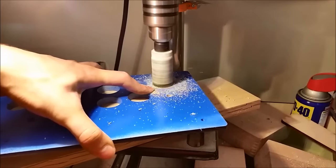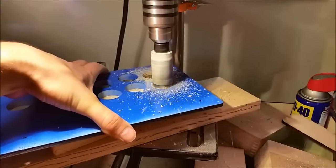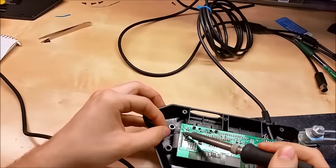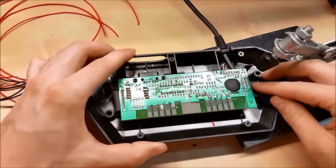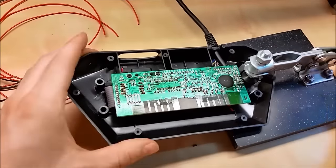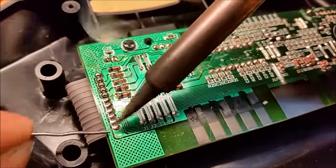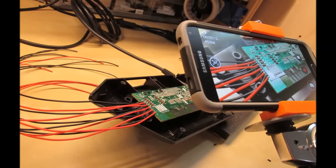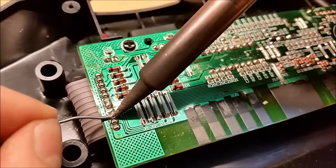Since I changed my mind and I'm not using the Konami pad, we need two more holes — so a total of six: start, select, and all the shape face buttons on the PlayStation controller. We're going to desolder this ground test wire and now connect a bunch of leads to each one of these. You'll see in this video my soldering job gets super sloppy, and that's just because I have a phone sitting in front of me while I'm trying to do all this work.